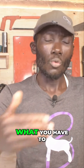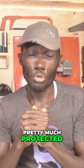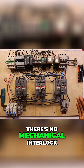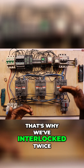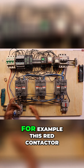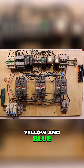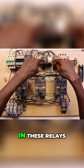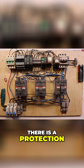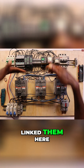This circuit is pretty much protected. The contactors have been interlocked electrically — there is no mechanical interlock. That's why we've interlocked twice. Each contactor goes through the other two contactors. For example, this red contactor has passed through yellow and blue. In these relays here, we've interlocked to make sure that there is protection — there is no time that these phases will meet, because we've linked them here.